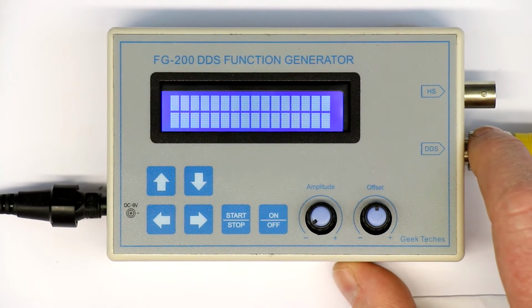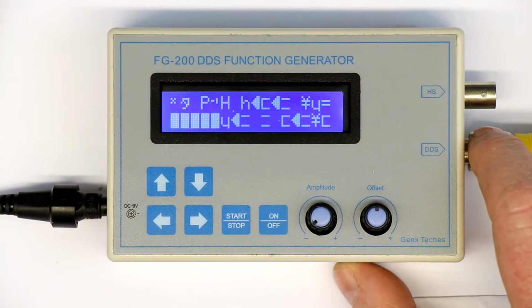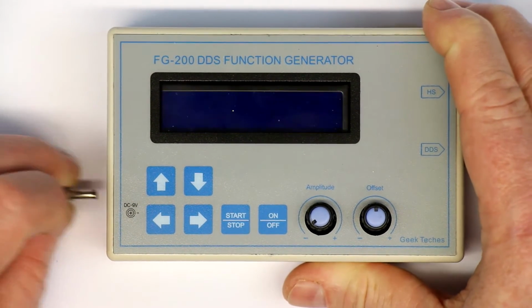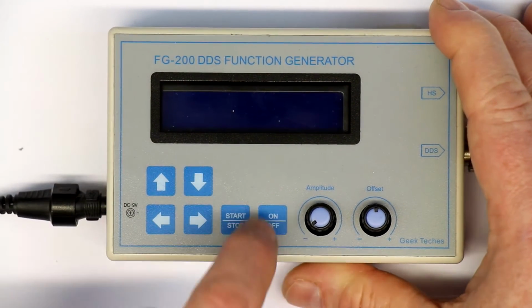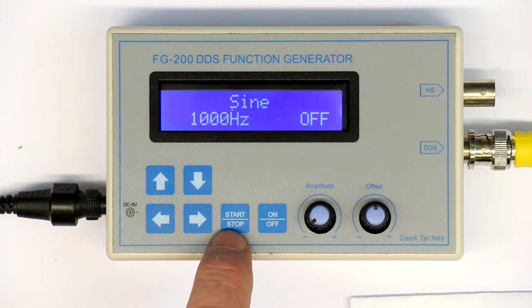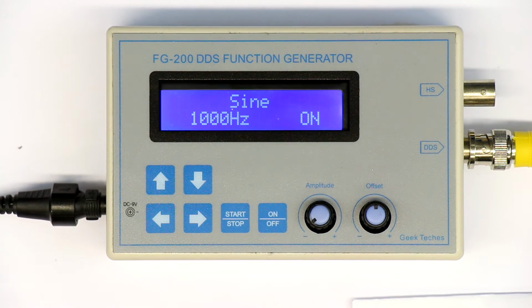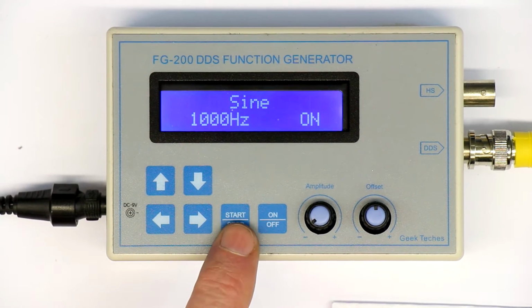I can't understand that there is any difficulty in putting in a software reset. So the next thing that's a bit annoying, you get a clean reset only by unplugging the power and then putting it in the on mode again. And what I just said, you quite often mix up the start stop and the on off, and you just have seen if you accidentally press the on off, the software goes out of bounds.